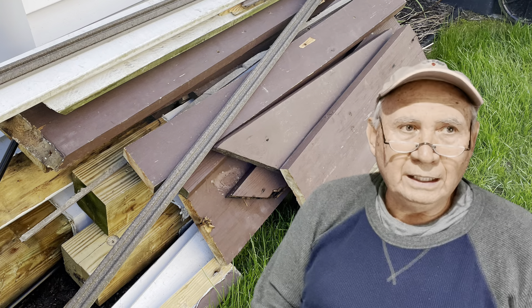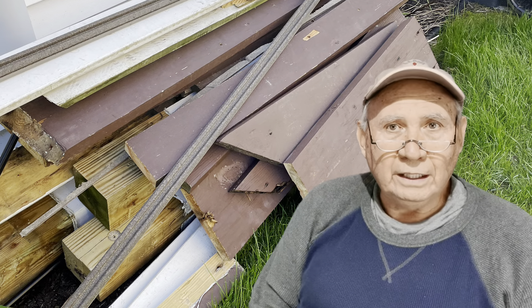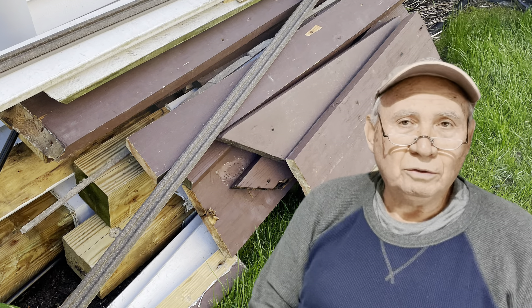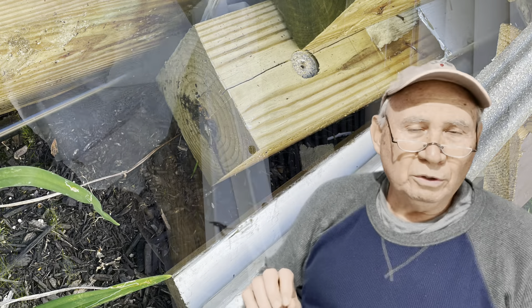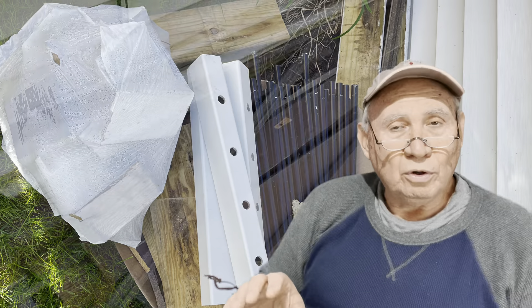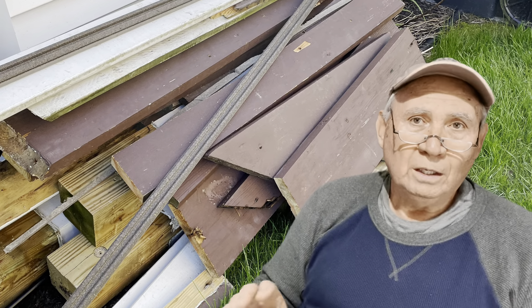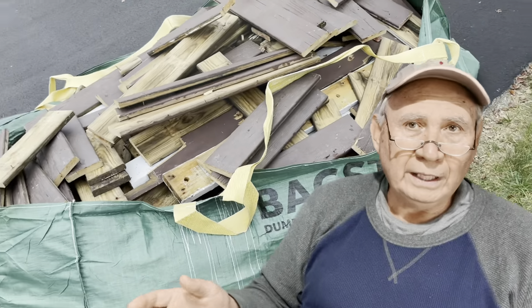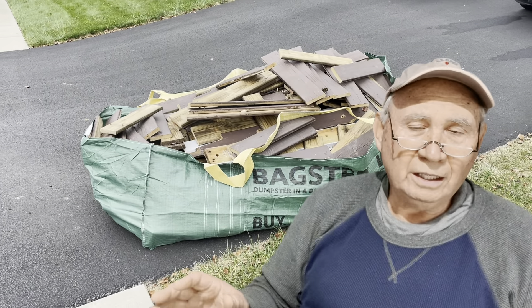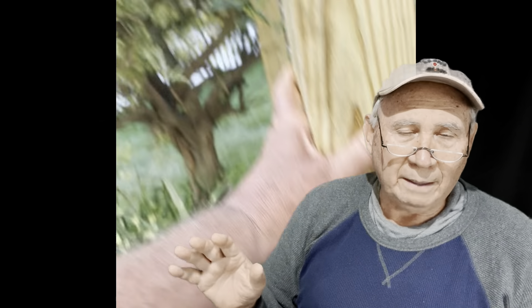We got into talking about it and the five-quarter wooden decking that's down there, we have to take all that up. The railing is made from eight-by-eight posts with round aluminum tubes for the railing. Him and the wife want all that out because the deck was built very strong, but the boards were very close together — no gap in the five-quarter boards, which is wrong. There's no ventilation for what's underneath, which can cause rot. She didn't want the eight-by-eight posts because it looked like a dock where you could tie up a cruise ship — the posts were huge. She wanted the smaller posts with the Trex decking and the Trex railing.